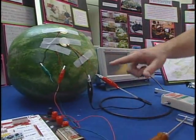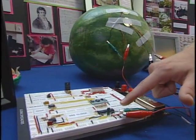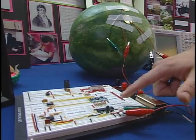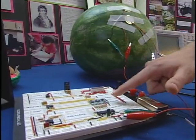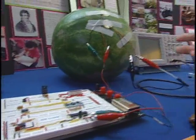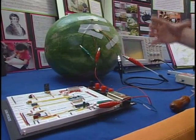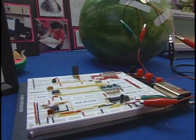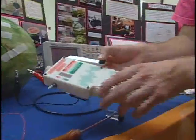it passes through into the circuit right here, and it has an analog to digital converter which converts this analog voltage signal into a digital signal, which is then passed to the Basic Stamp. The Basic Stamp has these parameters — if it's ripe, it has a decay curve of this amount of time, versus unripe at X amount of time. It then goes to this LED bar display and displays its brightness value, and you can kind of see it working here.